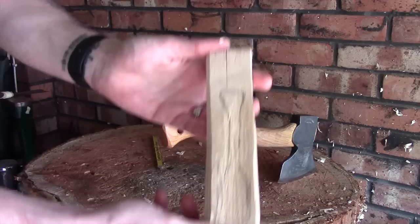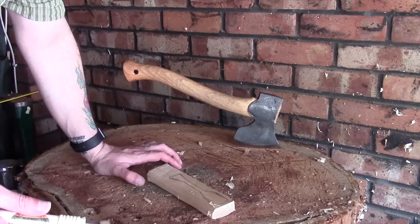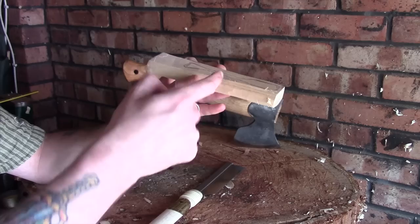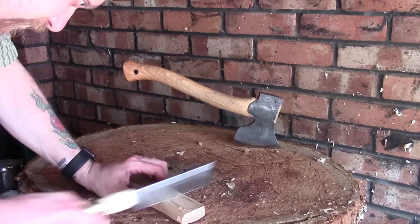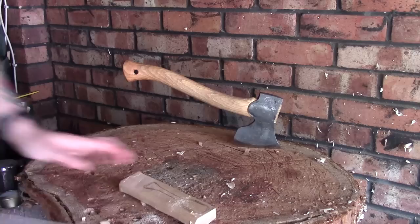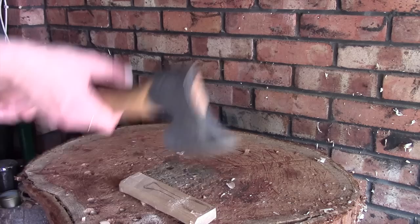There you've got a very basic spoon shape — we'll refine that as we go. The next step is to get a couple of saw cuts in. The first one I want to make is basically down here for the butt, because I want the bowl to dip in down here so the spoon is slightly angled. The easiest way to do that is a very thin saw cut where the bowl stops, and that's roughly halfway down this piece. I like to put that first marking in just so I know what I'm aiming at, and then you just come down with your axe.